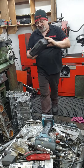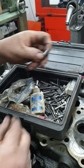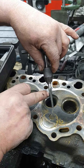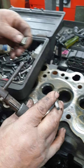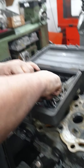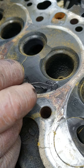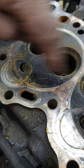I'll show what the plugs look like. This is my crack repairing kit — look how old it is. So what you do — you've got these plugs. We find the end of the crack, we drill a hole, we tap a thread — it's a tapered thread. We put a little bit of Loctite, you screw that in, and you tighten it until you snap it off. See that smaller one — we snap them off flush and we stitch it. So the idea is, if there's a crack like that, you drill a hole at each end, tap a thread, snap it. Then you drill halfway into that plug, snap it. So we're stitching it like that, then you pin it on top. This will never leak.